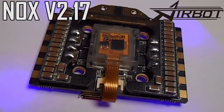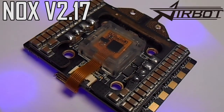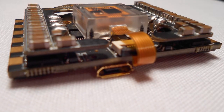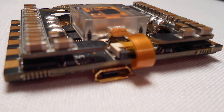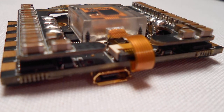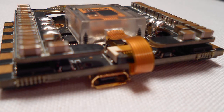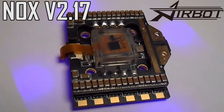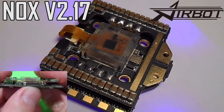So that's pretty much everything you're going to need to know about the NOX — pretty awesome, right? There are so many things that I like about this flight controller that it's hard to find flaws. But if I could change one thing, it'd probably be the location of the USB port. If you mount the board the way it's intended, the USB port ends up directly behind the camera, which could be a little tough to access. If this is a problem for you, you could always mount the board sideways — that'd give you easy access to the USB port and the battery leads would come from the side. This board is still in its early stages, so I'm sure we're going to see some improvements, especially since there's an expansion slot clearly visible on the front edge of the board.